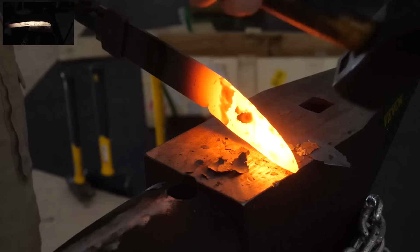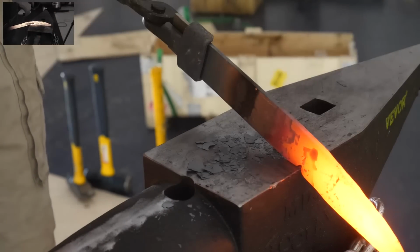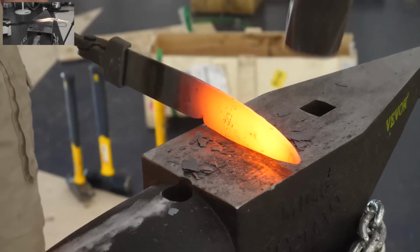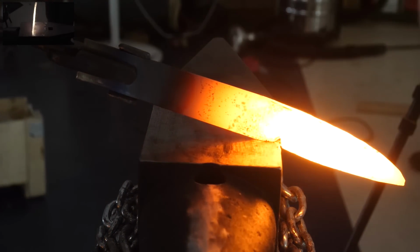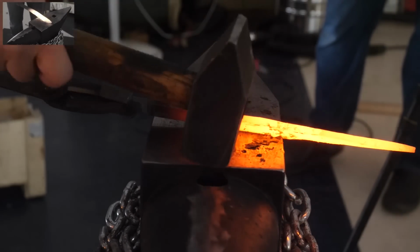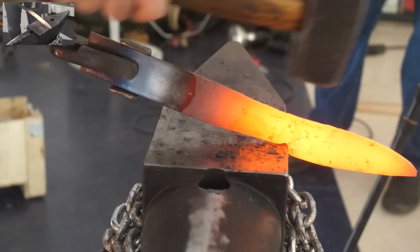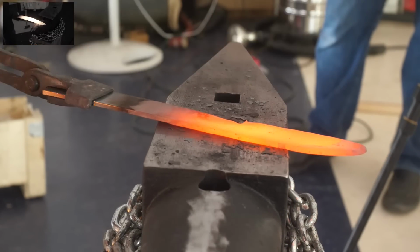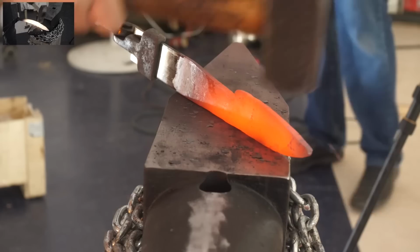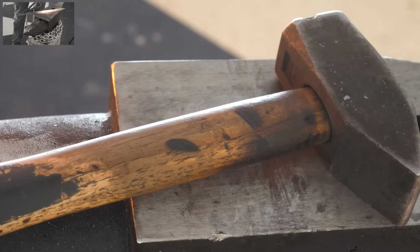When Vevor contacted me, they wanted me to start with a smaller anvil, and I asked them if I couldn't just move up to the 88 pound, and they agreed. And that's sort of my recommendation for knife making in general. The heaviest anvil you can afford is probably where you should start. You don't want to hamstring yourself by spending all your money on your anvil, but at the same time, it's pretty crucial. And I don't know that I would recommend, if it can be helped, starting at less than 80 to 90 pounds.